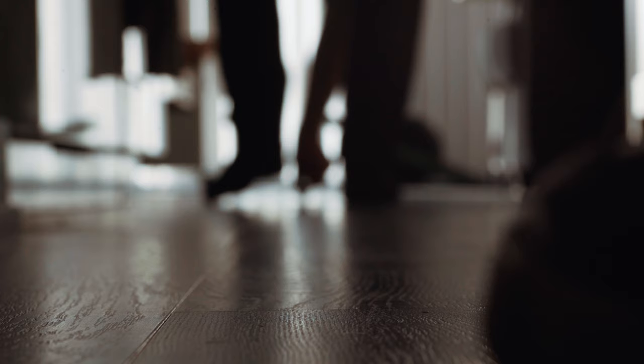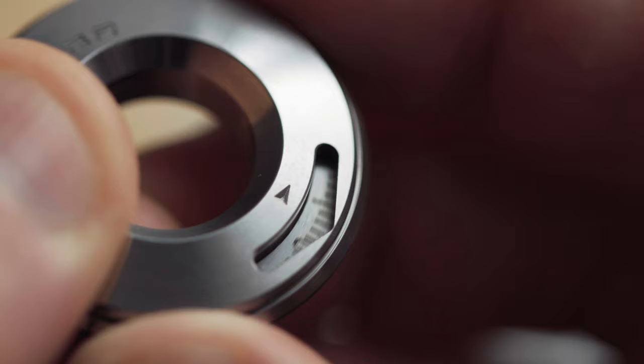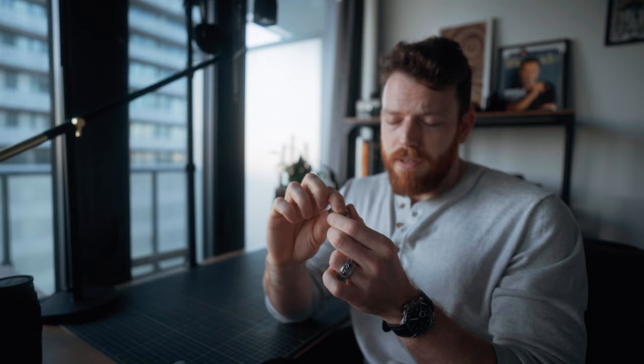The results of the long-range test are in. Interestingly, it came out slightly differently to the first set of results. The actual distance I measured between two known points was 7.335 meters or 7 meters and 335 millimeters with the tape measure. But the Ti Roller this time actually came in at less — 7,295 millimeters. I think this is due to the surface material being measured on. The ground is relatively slippery, a lot less friction than the mat I used the first time. With 73 revolutions, if it's slipping very slightly each time at that zero-lock, that's where you lose distance very quickly.